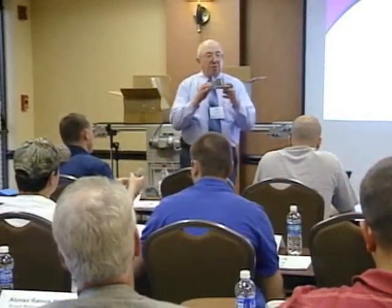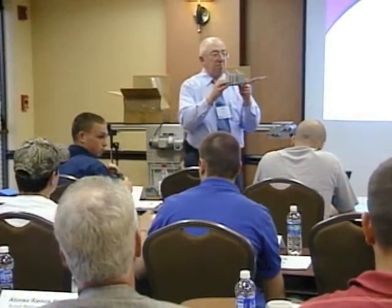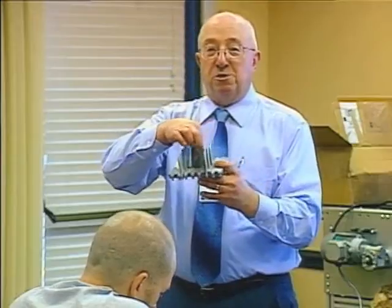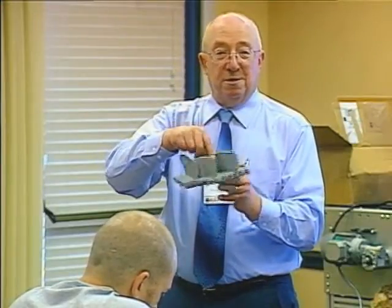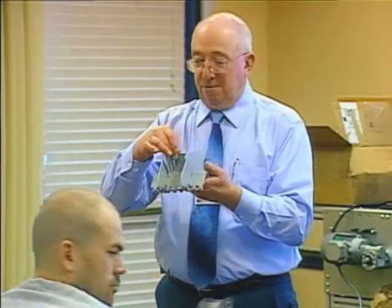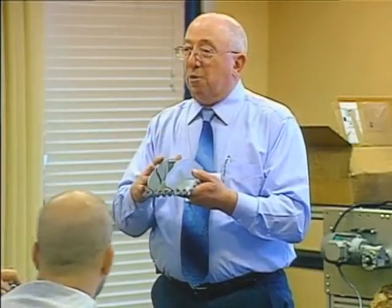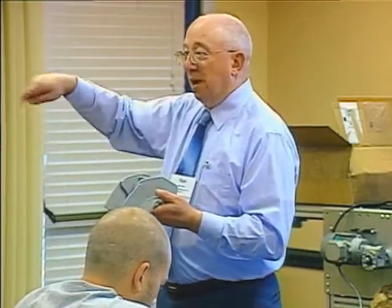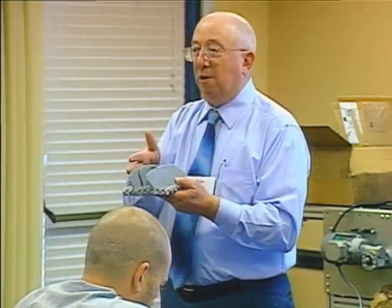If you want to put cleats on it, you can put cleats on it. This has a little bitty cleat on here. We don't have side walls. And by the way, in the plastic modular industry, these are called product supports. They don't call them cleats. They also have side walls or side guards in the case of modular. So instead of the corrugated sidewall that Roy was talking about yesterday, we now have side guards.